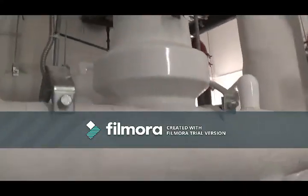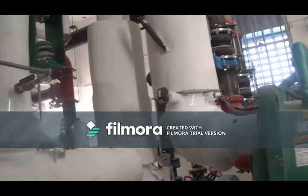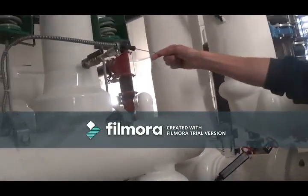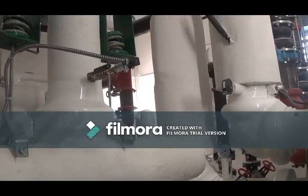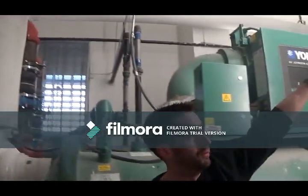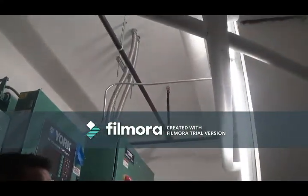These are your system water pumps. You've got, similar to your heating water pumps, one should be running at all times. You're rotating them once a week. We have pressure sensors again, so we can tell what PSI is going through the fan coils. And you also have a control valve up there for the winter fan coil temperature setback.